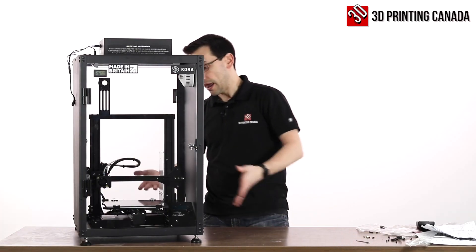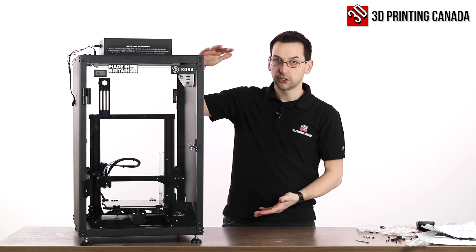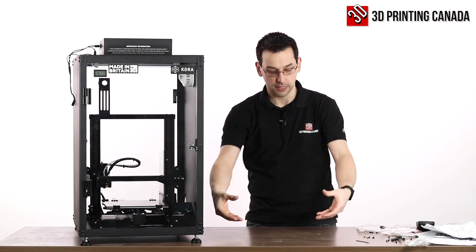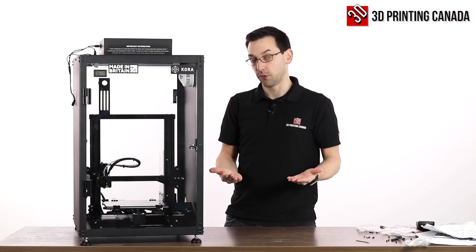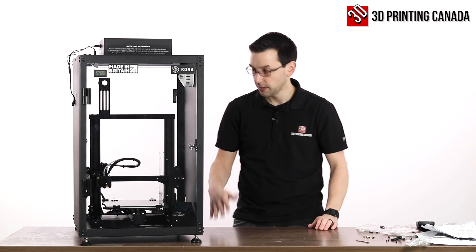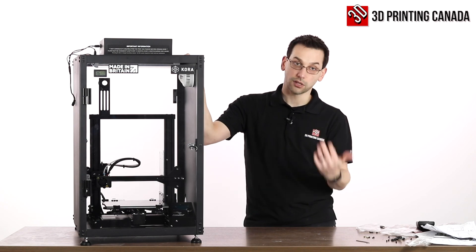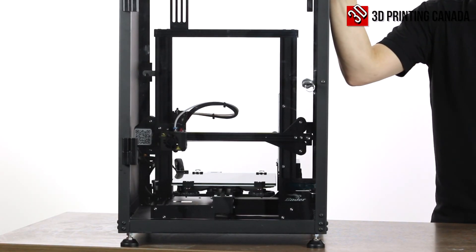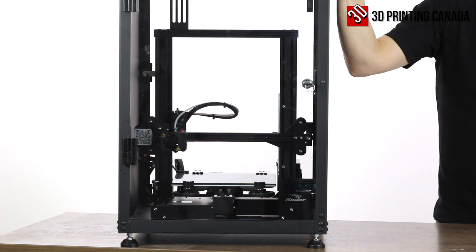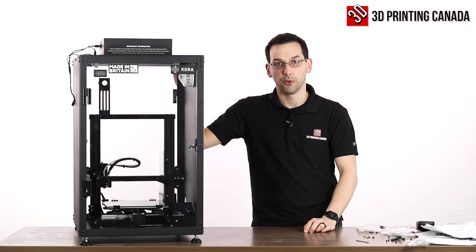As you can see, I've thrown an Ender 3 inside. This unit is basically the perfect size to fit something like an Ender 3. If you have something with a little more height, like the Artillery Genius, you'll run out of headspace because the roll is sitting on top of the frame, and the large base unit with all the electronics raises it off the floor as well. The last thing you'd need to do is feed your power cord through that teardrop shape we installed earlier. Stay tuned — in the future we're going to do a video of a unit printing in here, do some measurements on particulate outside and inside the enclosure, and use a phone app to measure the change in sound volume inside versus outside to demonstrate the benefits. Hopefully you found that useful. Remember to like and subscribe and ring the bell to get notified when we upload more content. Thanks for watching.